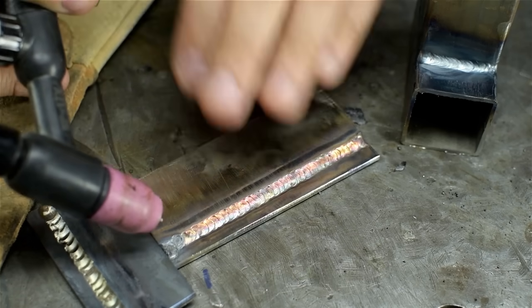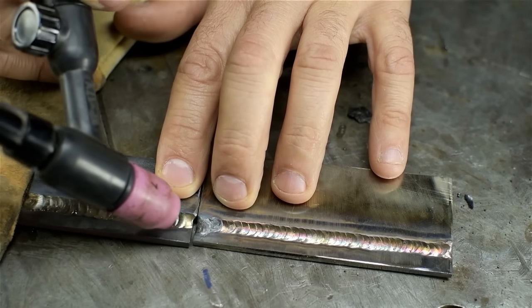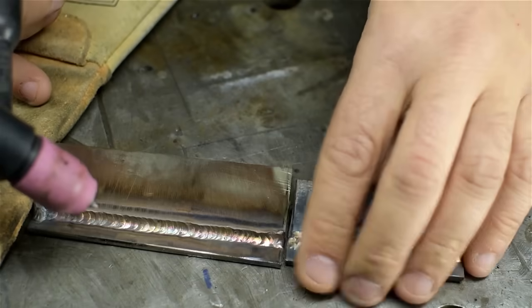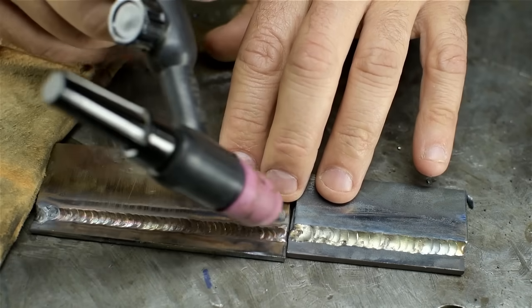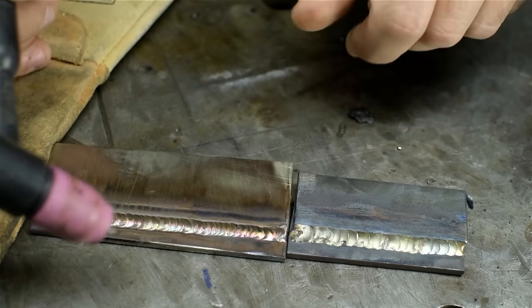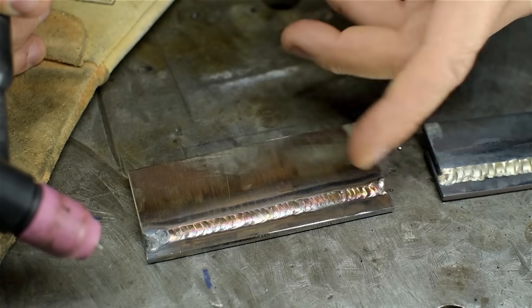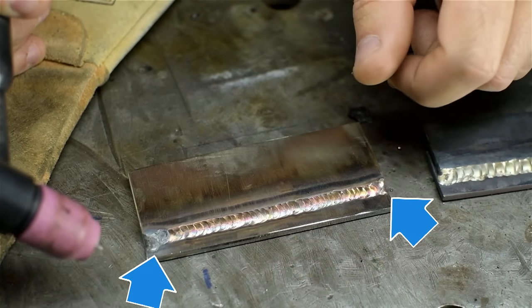For continuous welds, put a tab on each end, scratch start on your tab, weld it right into your work. When you get to the other side, weld off your work and back onto a finishing tab. Extinguish the arc there and then just cut those tabs off. You should end up with a decent weld and a clean part without a thousand little arc strikes and chicken scratches.